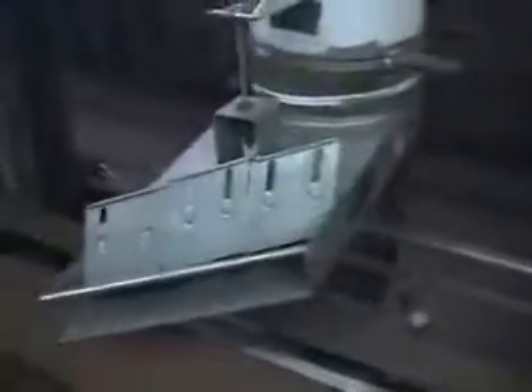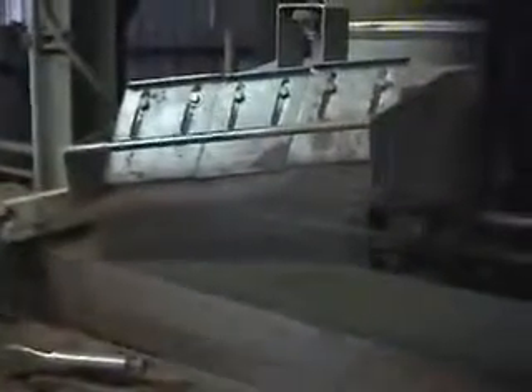As you can see, we have adjustable plates here at the end. These are all bias cut feeders, so they're off the brick line itself. That was an important design item — there are adjustable plates at the end so we can make changes to ensure we get a good flow across the entire brick line, across the whole column. These things are adjustable so you can make corrections to flow across the line. The feeder operates with what we call the geotray — this is the bottom feed tray. It's a mass flow hopper, so we don't get any bridging or ratholing.